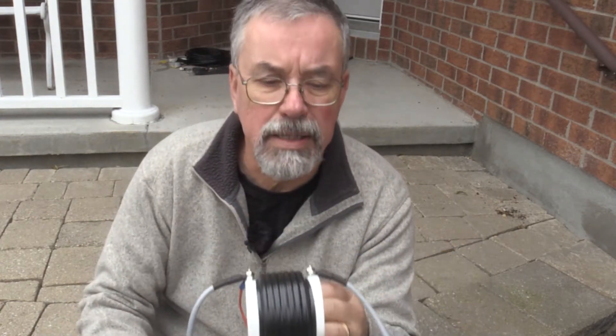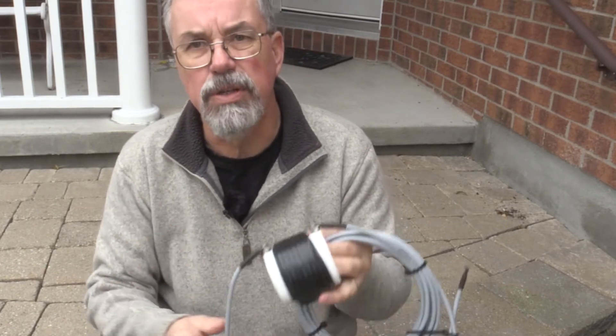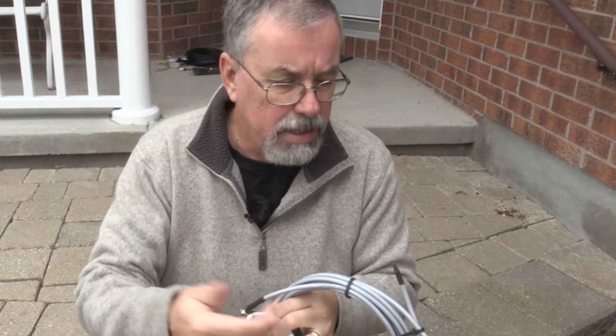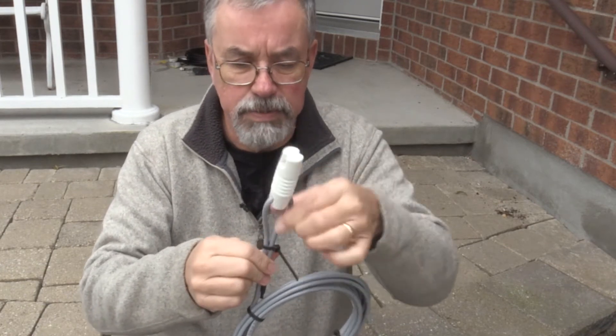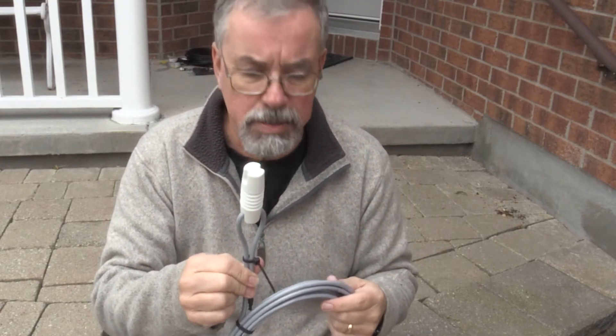On the coils, really well wrapped and it looks like it's been heat shrunk a little bit. Everything seems to be well sealed up. The only thing I noticed is that this hardware was loose — probably for packing — so we just tightened everything up and got it ready. Here's the adjustment point: a single tie wrap, and it's not very tight. We're supposed to pull that back or let it out depending on where you want your SWR to be.